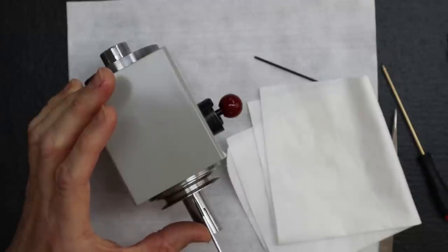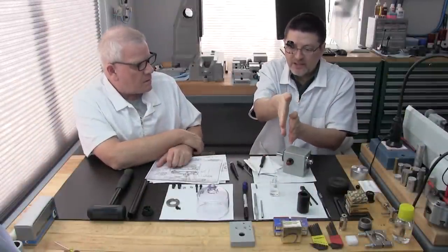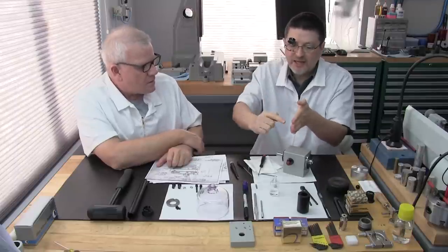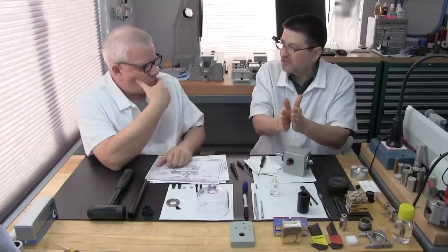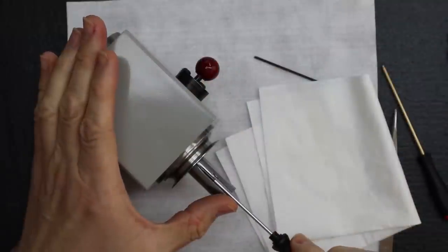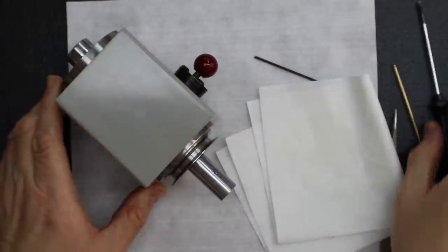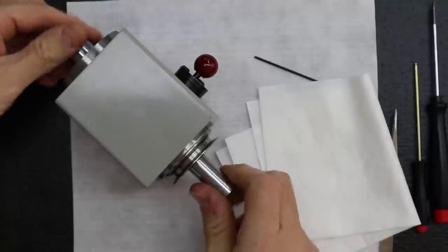We're going to squeeze that slot, right? The slot groove in the nut, right in the center. Yeah, it's a split nut. So when you tighten the fastener, it brings those two halves together and applies pressure to the thread so it won't loosen over time. And just a little bit now. Don't go cuckoo. Don't ruin your threads, because you will ruin the threads if you tighten it too much. So just snug. That's all that's required. There you go. That's one perfect spindle. Almost done.